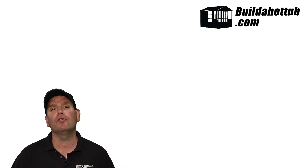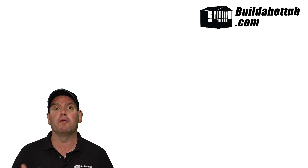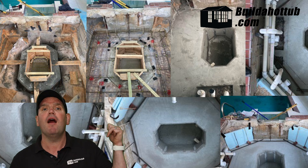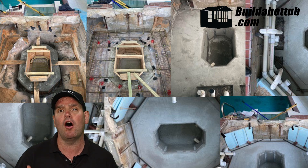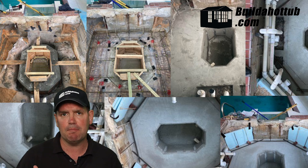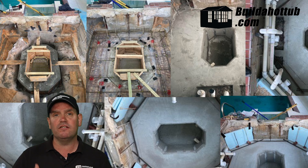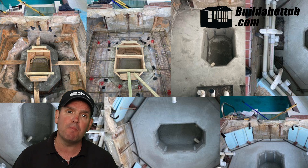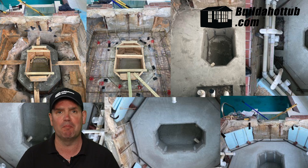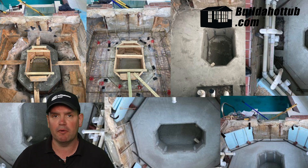After the base had cured, the next stage was to form up the actual lower seats or the bottom part of the seat. Rather than go through lots of individual photos, here behind me you can see a montage of this process. The key takeaway here is you must really brace your forms. Concrete is heavy, so wood will bend — it's got to be braced. If you don't brace it, you're not going to end up with nice perpendicular walls; you're going to have walls that have got bends in. So lots of bracing, please, when you are forming up for a concrete pour.